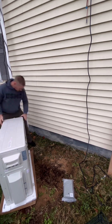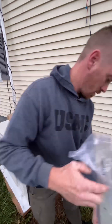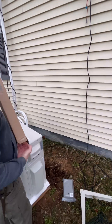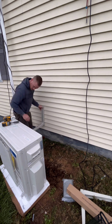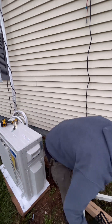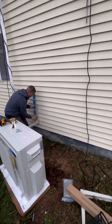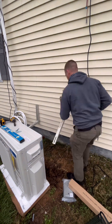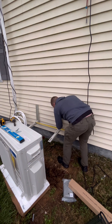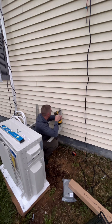Then I go outside to my outdoor unit and I'm going to install this bracket to keep it off the ground instead of doing an actual slab foundation. I really like these brackets — real simple to use, fit most units. I'll put a link in the description if you're interested. I found my studs and each one of these brackets has four lag screws going straight into a stud, so this is going to be as solid as it can be. Works a lot better than doing a concrete slab and just keeps it off the ground.